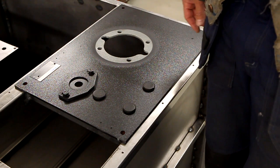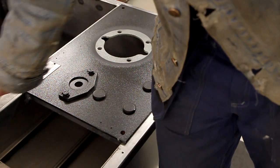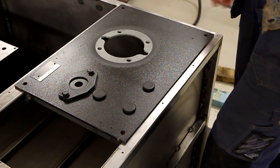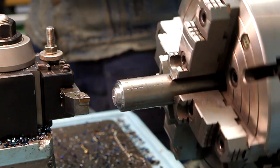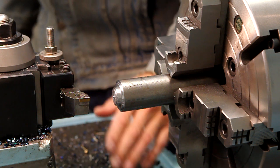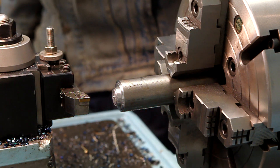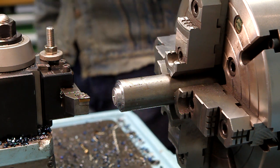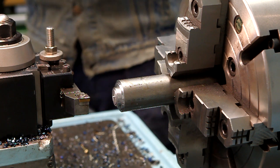So we have slightly less than that tolerance in the hole or the threaded positions. Now we are going to make the last of the inserts — M10 threaded inserts for the top lid. It is going to be 20.1mm in diameter and 47.7mm long.